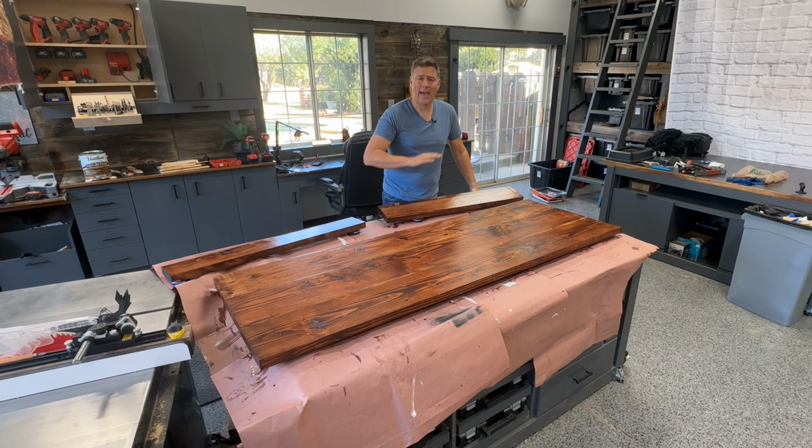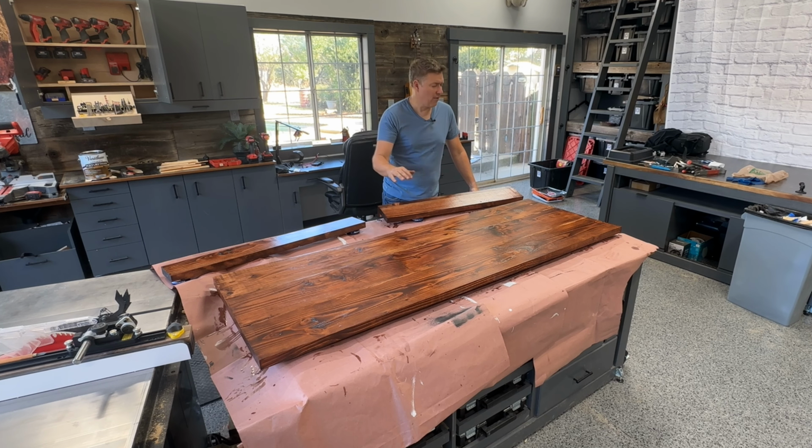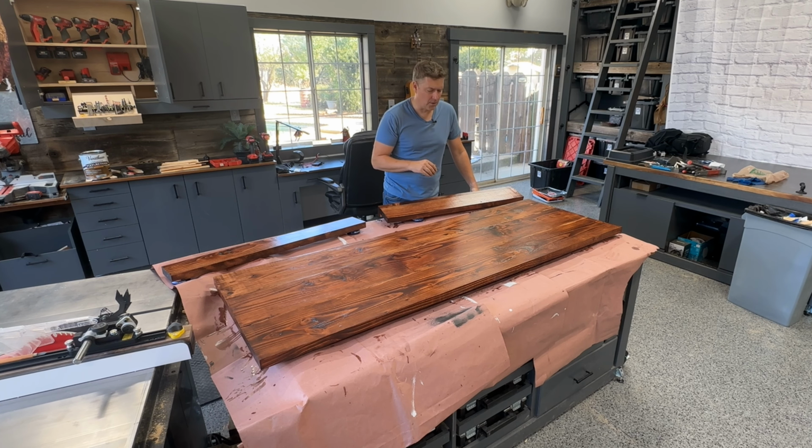So I'm going to go ahead and add another one. It's been 4 hours since I did my other one, and you can recoat after 4 hours under the assumption, right? Room temperature, it dries normally, right? Because if you're in lower temperatures or higher humidity, it will generally take longer for it to cure. So I am going to elect not to sand it. I know every video you watch, it does say that you should sand between every coat. And again, that is just to minimize alterations.